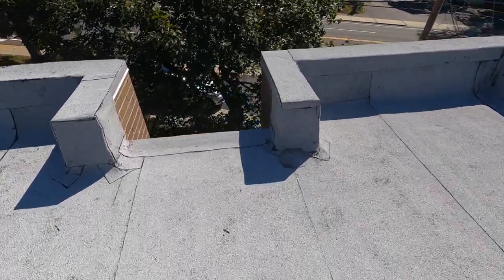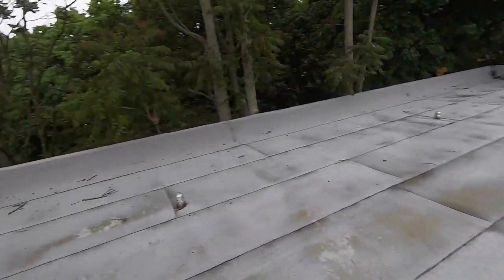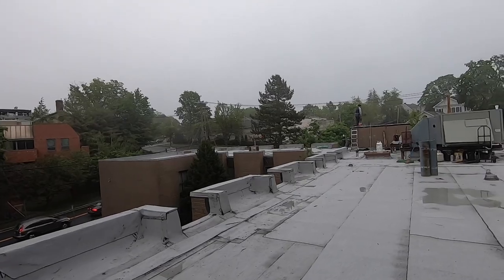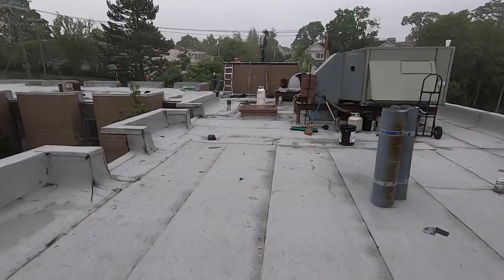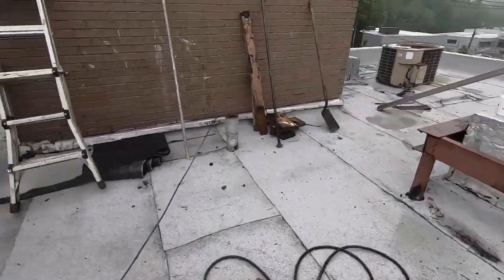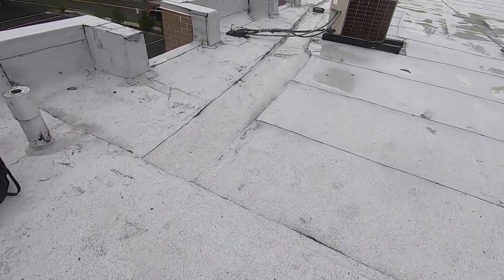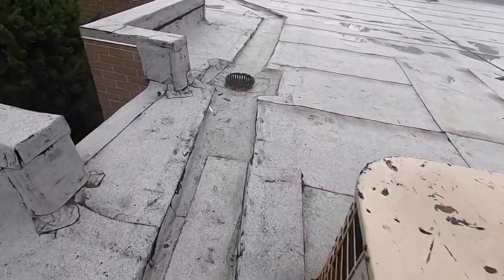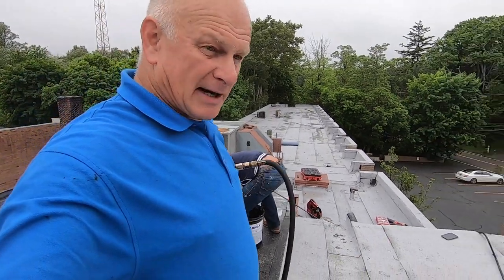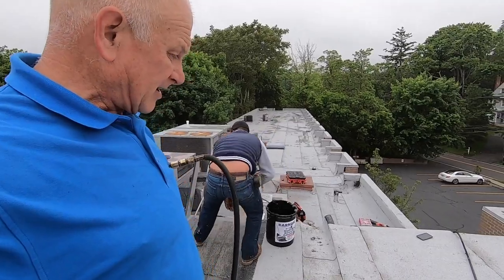It rained last night and you can see there's not much water on this roof where there used to be huge ponds - you could have kept fish in here with how much water there was. Huge leaks before, but with all the channels we made, here's another channel right here where water used to sit all over this area. There used to be a four-inch pond right here. There's almost no water on the roof and it's drizzling right now. The rule of thumb is if puddles can evaporate within 24 hours, there's no problematic standing water. This is not the prettiest job I've done, but it's practical, done inexpensively, and the owner is happy. No more water on the roof.